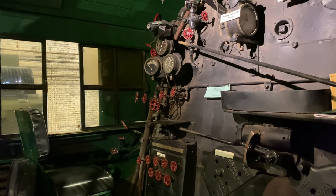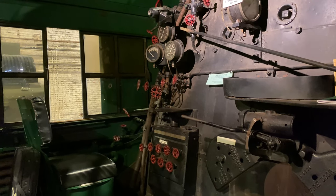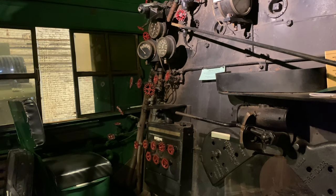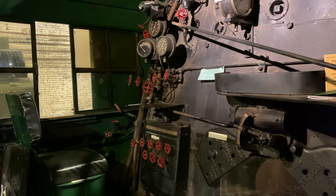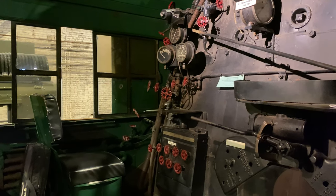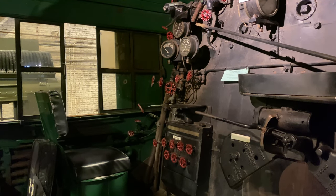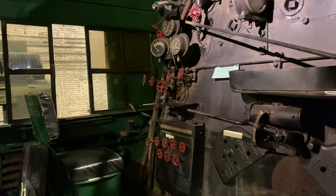But obviously, if your throttle is closed, there is no steam being supplied to the cylinders, or at least not enough steam, and so there is no exhaust steam to preheat the water. So if you're allowing the pump to run at full capacity with the throttle shut off, you're just pumping ambient temperature water into the boiler, and like I said before, you definitely don't want to do that. That's bad for the boiler. It stresses the stay bolts and the firebox sheets. That's how you break things, and you don't want to break things in the pressure vessel.